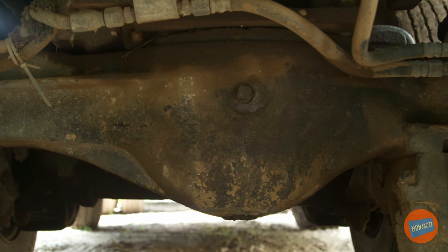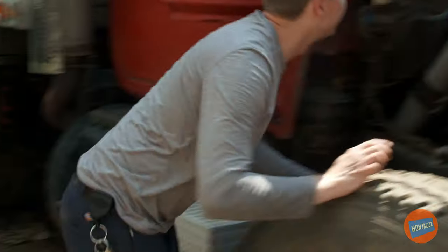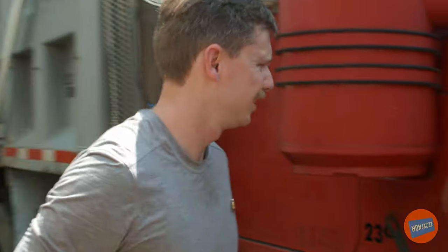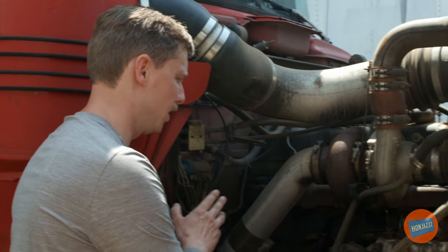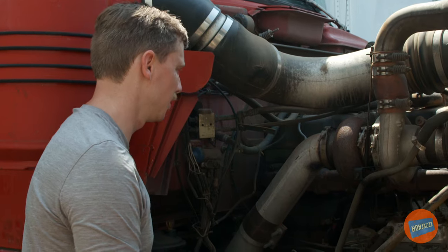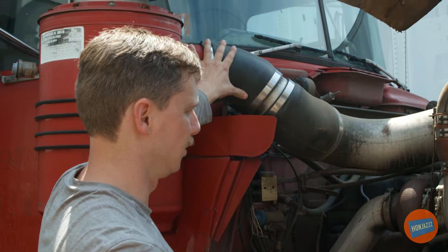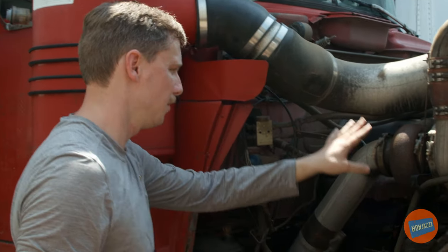The truck has all the accessories as far as trailer towing and capabilities for dumping different types of products — it's a very unique truck. It's got traditional Mack rears, camelback suspension, 11R22.5 tires, and a heated body, so if you're running asphalt the body's not going to freeze. We have here a classic Thermodyne engine. These engines don't historically make a lot of power, but they will literally run forever — it's the classic split rocker box, simple Thermodyne engine, all-mechanical fuel system.